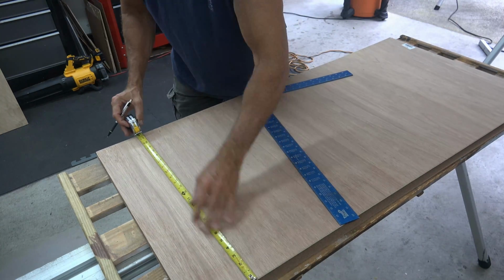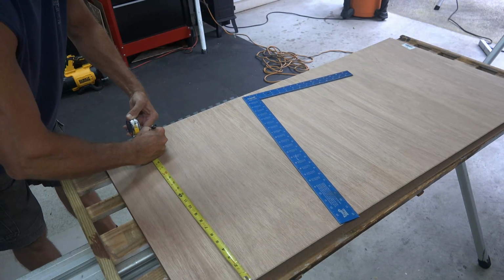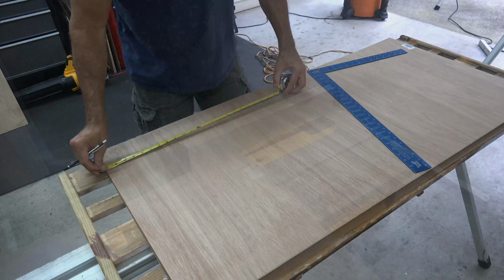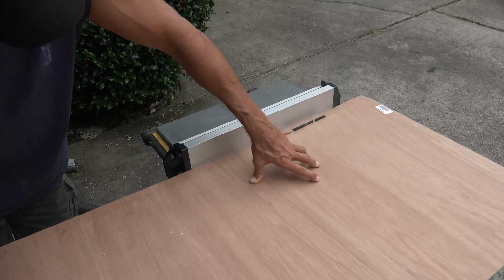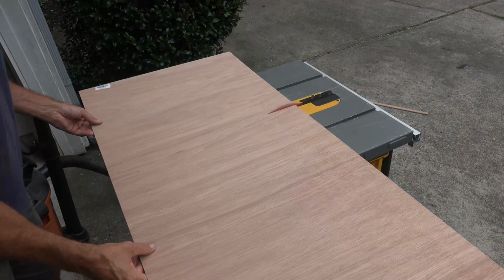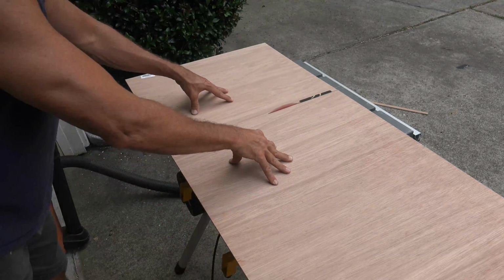Measure from the end of your groove to the other end of your groove on each height and width piece. Then using a piece of birch plywood, make your marks. I chose the birch for its weight. I knew this was going to be hanging on a wall, so I wanted it to be as light as possible.